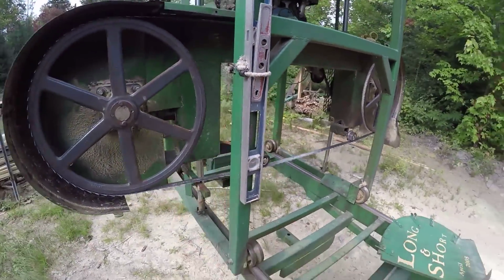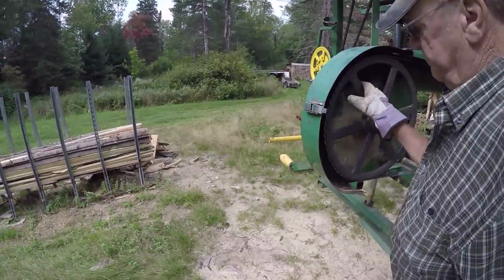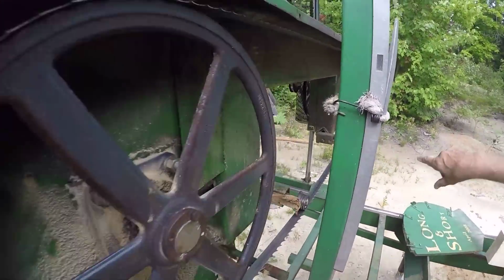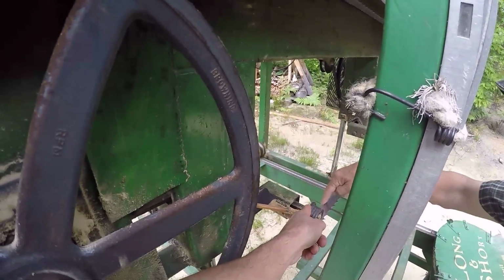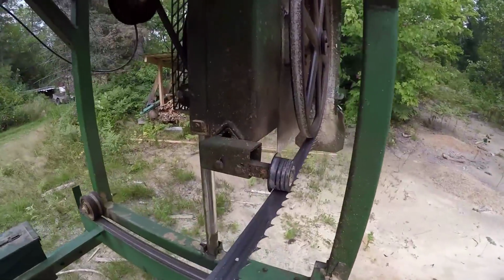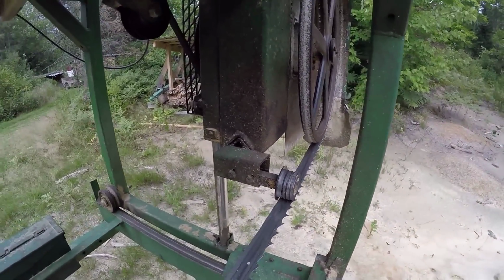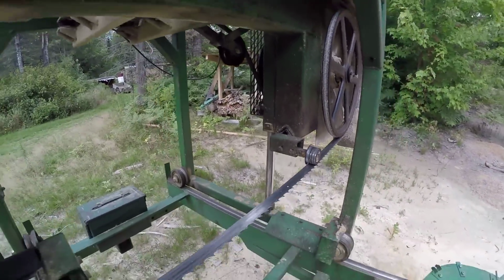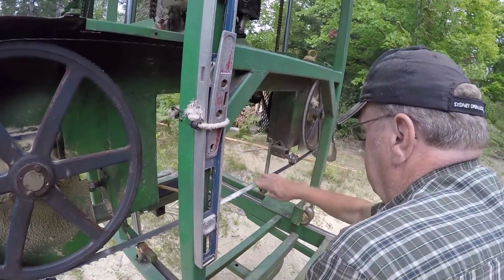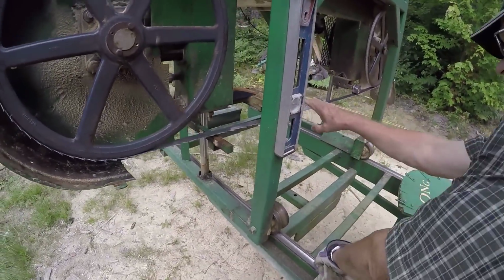And you should have a 1/8 of an inch, roughly speaking, out from that kite. That plate running, you see? 1/8 which way? From here to the plate here. Oh, 1/8 space. Yeah, like you see here. Yeah, that's the way you have to set it. And of course you can adjust it with the set screws, set bolts. Well, these have to be level this way and that way. That plate has to be level, same as the bed here, and this one same thing that way.